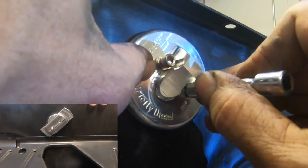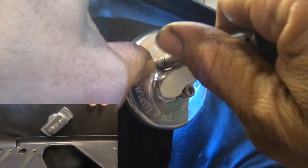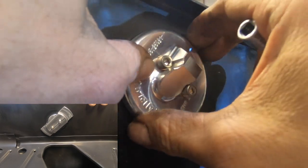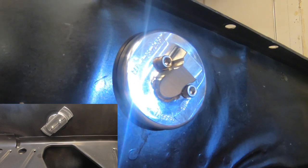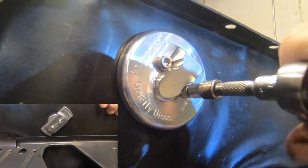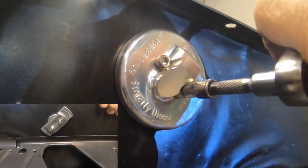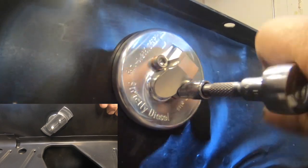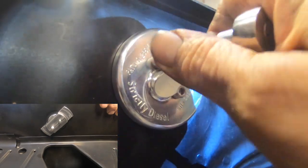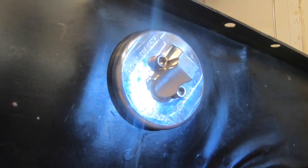At this point I give a little tug on the bolt, I cannot feel it coming out, so I'm gonna thread this one in. We are almost done. Here's where you overcome the Teflon tape. You're gonna want to tighten these bolts to 100 inch-pounds, give or take.